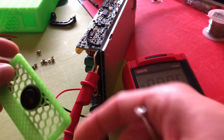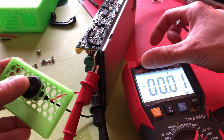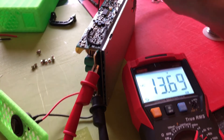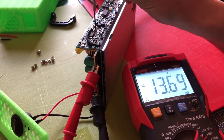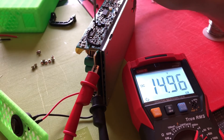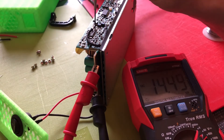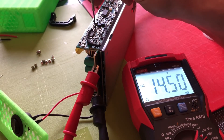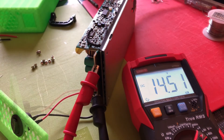Turning it on by this little switch. Right now we're getting around 13.6 volts out of it, and now we can adjust it up to 14.96 volts — that's awesome! I will leave it around 14.5... a little bit more... too much... there we go, that's enough.